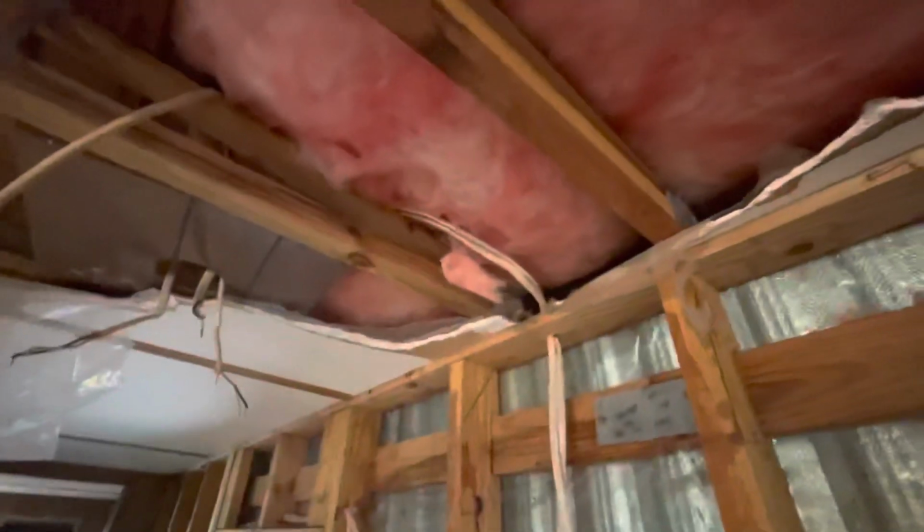These are the ones that I hate, everybody. I hate it when they run wire over the top of the rafter. Metal's always rubbing on that wire. So that means when we put a rubber roof on this thing, because of the way this one here was all the way over here, if I put a roof on this thing, I would have been in trouble. I would have probably screwed my boards right to it.